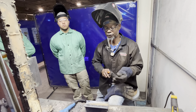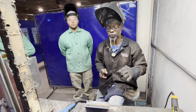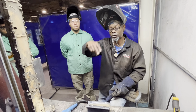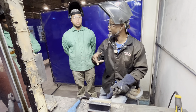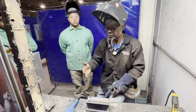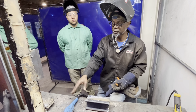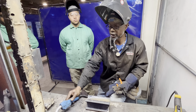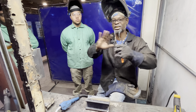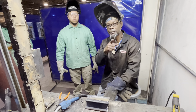For those who want to do self-shielded flux core without gas, it's the same process but more like stick welding — similar to 6010 where you have to do circles or back-and-forth manipulation to get the weld to perform correctly. With dual shield flux core, you can literally run it flat, vertical, overhead — just run it straight and it lays in there like a 7018 rod. Hopefully you find this helpful, and keep getting your weld on.